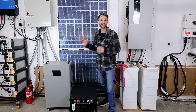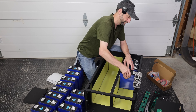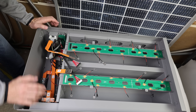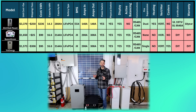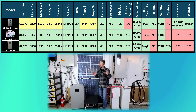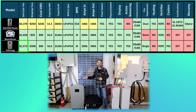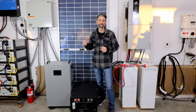Finally, we have two form factors for the Yisheng Energy battery. My current build video on my channel is for this horizontal stackable unit on the rolling cart, but there's also this vertical form factor which I happen to prefer, and I'll explain why in a minute. The assembly and setup for these two is almost exactly the same, so you can follow the horizontal build and use it for this case without any issues. The version I'm pricing in this comparison is the vertical battery with the 314 amp hour EVE cells. They have an actual capacity of 325 amp hours, and that gives us a total capacity of 16.6 kilowatt hours for this DIY battery as well. The cost for the US source case with 314 amp hour batteries is $1,573 tax included.